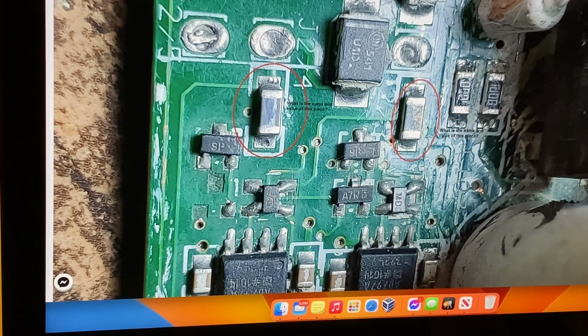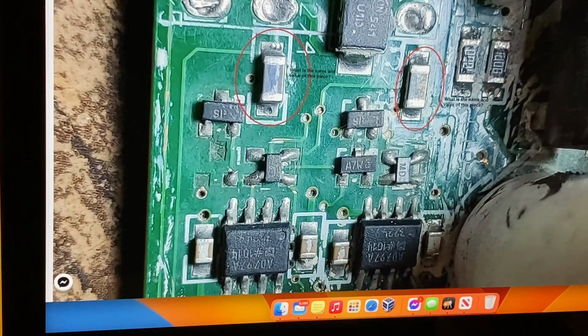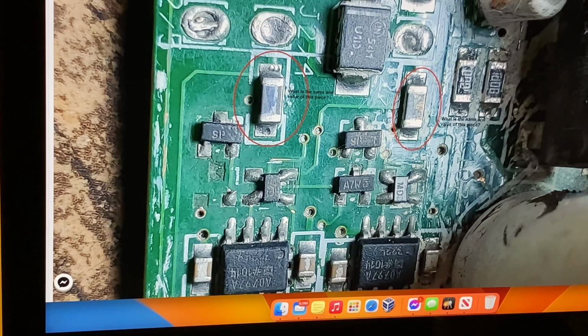Always check for that. And also that other one, it's not on this picture, but there's another MOSFET there, which is a clamp MOSFET for the 200 volts, drops it down to 185, 190. They fail all the time as well. This is something worth noting, that they fail when people have the detector on and disconnect and reconnect coils while the detector is on.